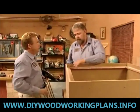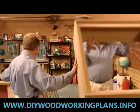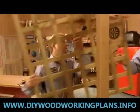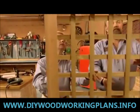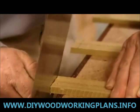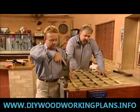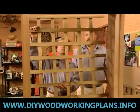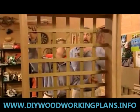Now mark the lattice. Then we measure and mark the lattice, which we will screw to the Meranti frames. Because the lattice is not manufactured to precision standards, sizes may vary and, like we did, you might have to remove the batten and trim the lattice to size.